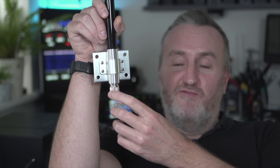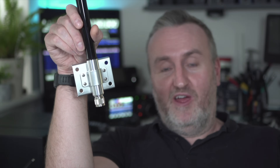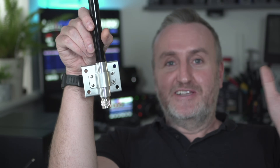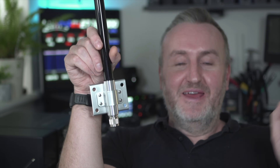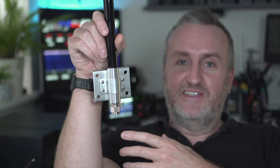What you've got to be careful of is the coax cable that normally comes with these antennas — you're going to lose a lot of signal in it. Because LoRa is such a weak signal mode you're dealing with tiny power levels, and you can literally lose like half your incoming and outgoing signals in a bad bit of coax. It's a good idea to have your node mounted right below the antenna to minimize cable length, though that raises questions about weatherproofing and power.